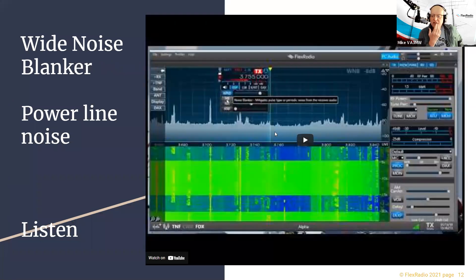I'm going to show a video of a very powerful tool called the Wide Noise Blanker. It's very good at repetitive power line noise — it monitors an entire spectrum about one megahertz wide from your VFO and removes that noise. I recorded this on 80 meters about a year ago during a net. Pay attention to the noise coming and going — the big green horizontal bars are noise energy hiding the signal we want to see, while the green vertical bars are a QSO, with blue being the noise background.